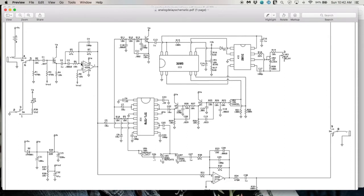But wait, we've got some components right here. We've got a capacitor in series with a 10K resistor. When the signal goes up in frequency, eventually this capacitor starts conducting. And when it does, then this 10K resistor starts being in parallel with this 47K resistor. This changes the input resistor of this op amp, and it lowers it dramatically. So you get a step in the frequency response. This is a shelving filter. So at a certain frequency, the gain goes up quite dramatically. I suspect why this is here is just to control the bass response of the signals going through here, so this and the capacitors inside here are not overwhelmed with too much signal.